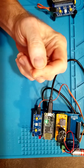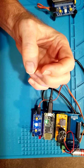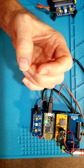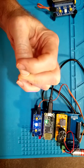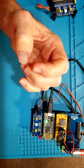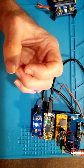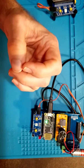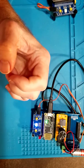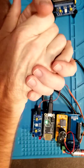If you don't want to run it from the beginning again, I believe the serial output will just pick up the print messages that come later in the program. So you can jump in with the serial window in the middle of a run, and I believe it catches all the subsequent print output. So you don't have to have the serial window open from the beginning. I'm pretty sure, I know I've seen this work in the past. So the serial window can get confused, and you just have to reset it.